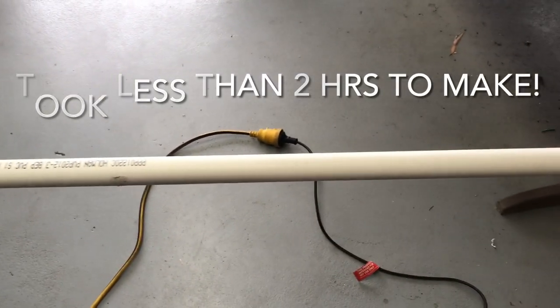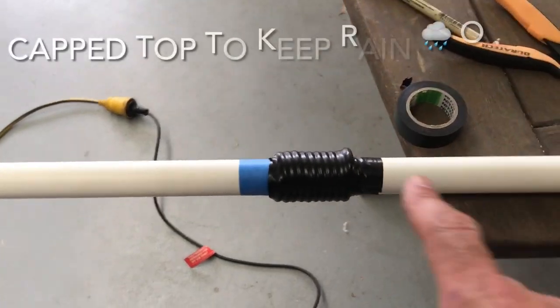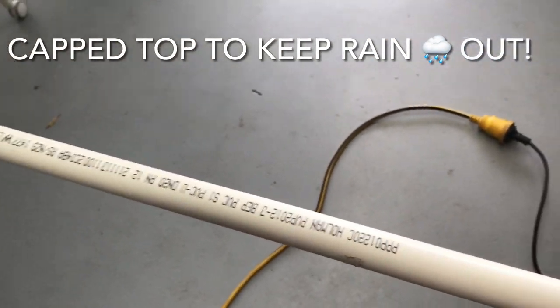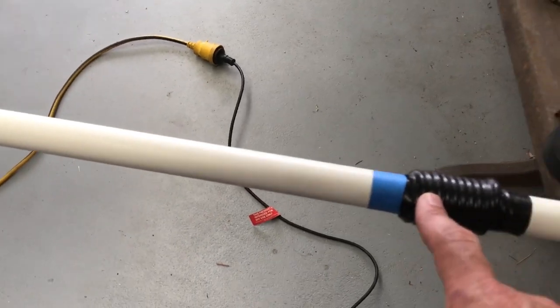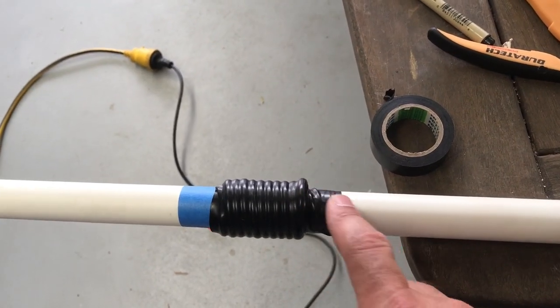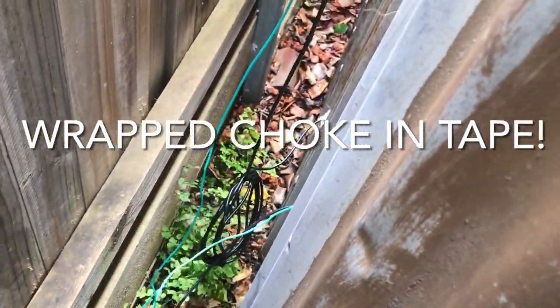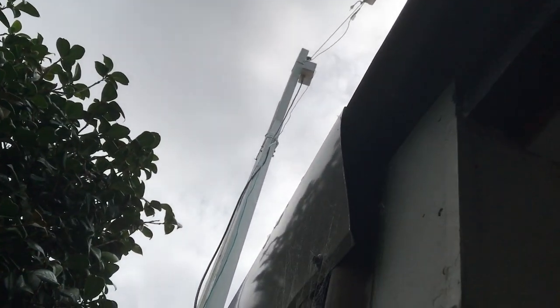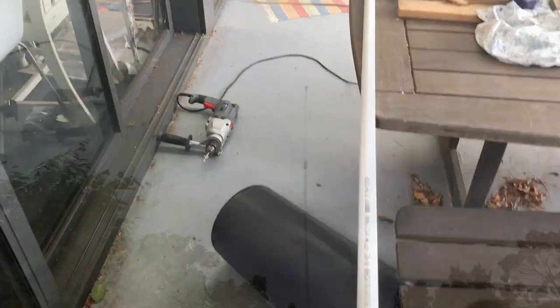So this is how it looks so far. If it works alright, I might take it down and weather proof it — well, that's not going to happen. Inside here we've got the dielectric and central core, then the uncut coax goes into 10 turns to decouple and help tuning, and then the coax runs all the way through the centre, comes out the end, and runs into the shed. It'll be at a reasonable height, and we'll then put it on the Nano VNA and check the SWR.